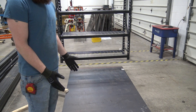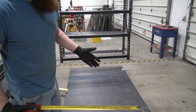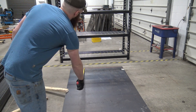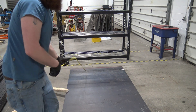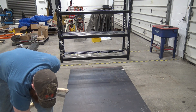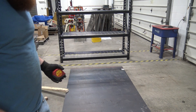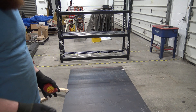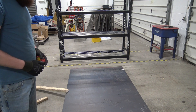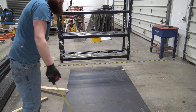Our plate here, our 3/4 plate — I use metric, so you guys are going to have to learn how to use metric if you're going to follow this. We are 2470 on length by 1220 wide. I'm going to leave a 50mm gap on either side, so I need to take off 100mm on our lengths of the tubing, going this way and this way.